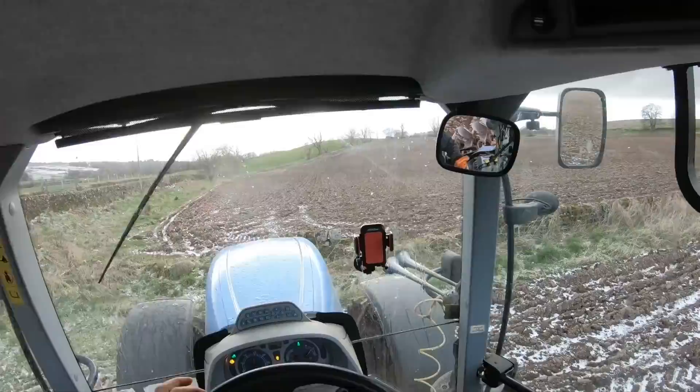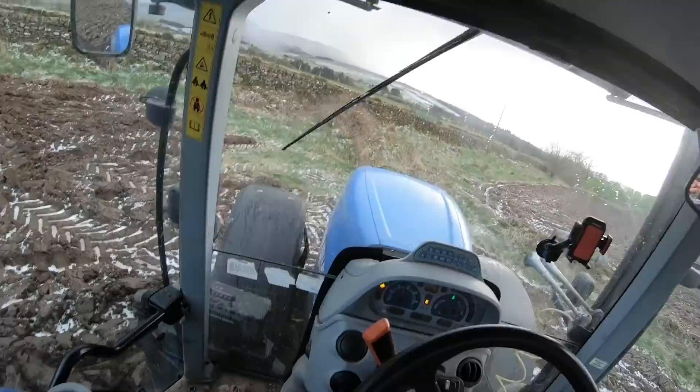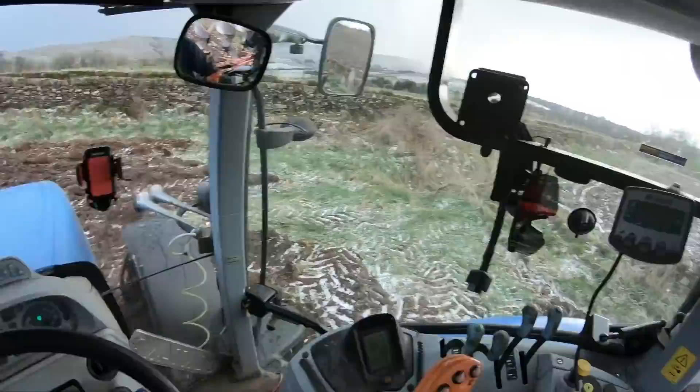Because I've had to turn the plough out to come down here, ploughing it the deep way, I'll need to get out and shallow the land wheel for going back up the way now. While I'm at it I'll put the other one back in to where it was — 16 turns in.